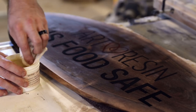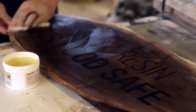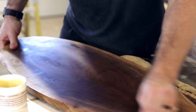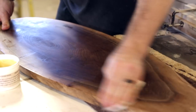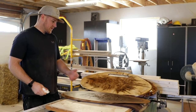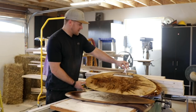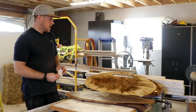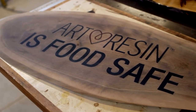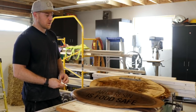The final stage is applying a wood conditioner to the board — a mix of mineral oil and beeswax. It helps condition and protect the wood and makes it food safe. It's good to apply this once a month because as you clean the board some of it rubs away and you lose that luster over time. When you've sanded a board up and finished it with the board butter you get more of a matte finish, whereas with the art resin it's more shiny. The resin finish requires less maintenance — it's protected and good to go. I'm really happy with how both turned out; you get a feel for the different uses and applications and the different varieties of wood.